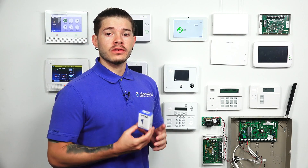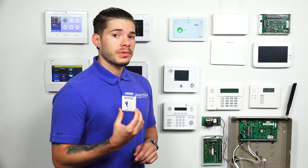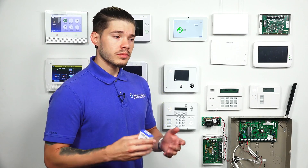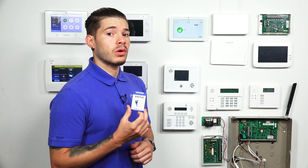Before you start learning your sensor, you want to make sure you have the correct IQ2 Plus panel, because there are about six different ones, and that you have the correct sensor. The one you want is the one that has a 319.5 daughter board card built in — the Interlogix and Qolsys daughter board card. There are two others with Honeywell and 2GIG legacy daughter board cards, and two with DSC legacy daughter board cards. Also note the IQ2 Plus comes in AT&T or Verizon versions. Make sure you have the Interlogix and Qolsys daughter board card, or else this sensor will not work. When I go into the programming screen, I'll show you how to confirm you have the correct panel.